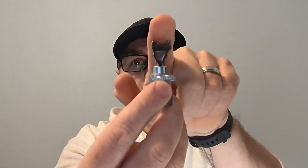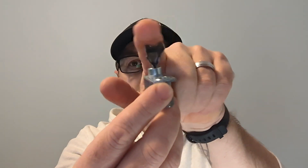This piece up here on top is called a hood. There are a lot of different types of hoods — left tip, right tip, center tip, ones that go out both sides, and round ones. The most common thing to pay attention to is the direction. If you go to replace a pilot assembly, always make sure you go back with the same one. Take the pilot assembly, face the back screws toward you, look at the hood and see — does it go left, right, or straight? That's your pilot tip direction, and you want to make sure it's pointing the right way toward the burner.